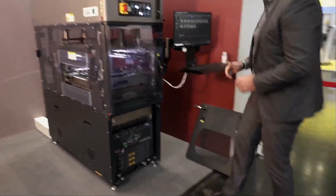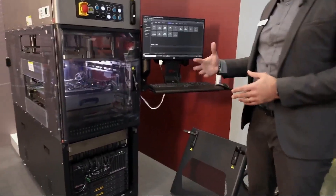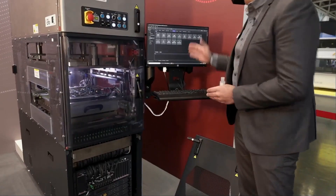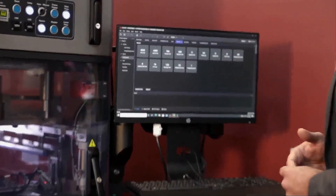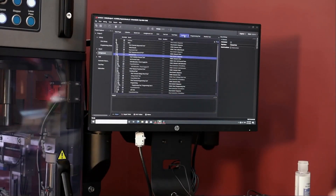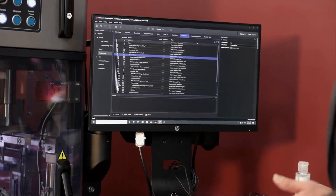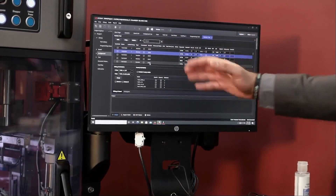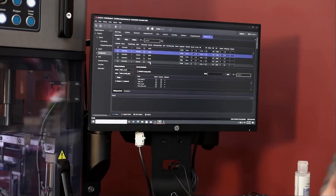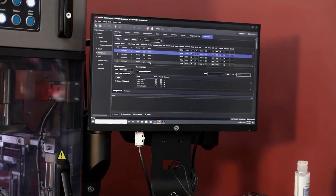Let's close this and go to the software part. The software part of the i7090 is quite user-friendly. As you can see, here we have the test list with the number of pins, shorts, resistors, capacitors — all the tests. Here we have a view of our test plans with the different tests we are performing. And if you want to dig deeper into the debugging, we have, for example, the list of resistors we are testing with the different limits that we can change and update during debugging, which makes it quite easy for users to debug.